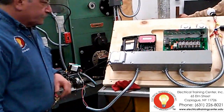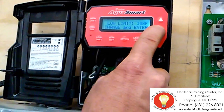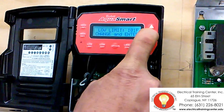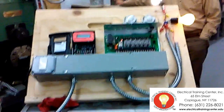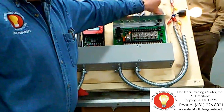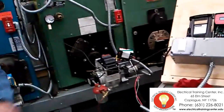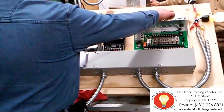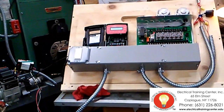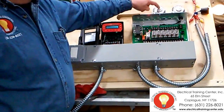When the temperature does rise to that point, we will have the ability to have a circulator on. For demonstration purposes, I'm going to lower the low limit, which is also the setting for circulator operation. So now you can see what I did: I changed the low limit set points so that you can see circulator operation without having to wait too long. We were waiting for this boiler to heat up. At the same time, you've heard that burner shut down because I did change the design temperatures on it, so we're not going to have that high a temperature coming out of the supply line. When we turn up a thermostat, the Argo switching relay panel — which is a circulator panel — allows circulator operation for that chosen zone.